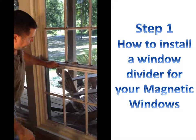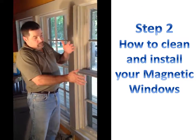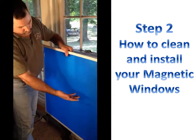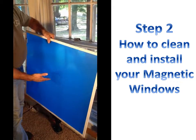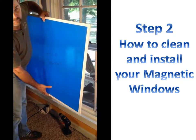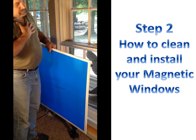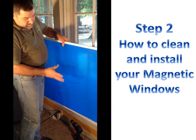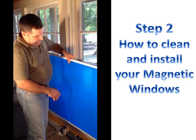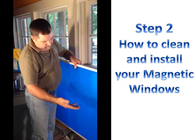Now you're ready to install your panels. Maybe you've ordered your windows to be divided into an upper and a lower section, or a left and a right section. Now we're going to write on these panels — for example, that this is the office window and this is the bottom panel. You can tell from the orientation of the writing which is the top and which is the bottom of the panel. That's important, especially if your window is out of square, because we're going to make it exactly the size of the dimensions that you gave us, so we want to make sure you're putting it in the correct orientation in the right opening.